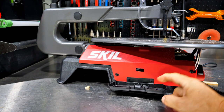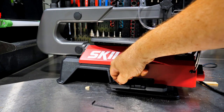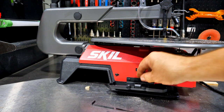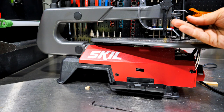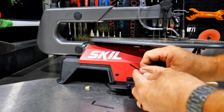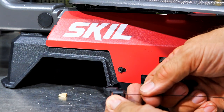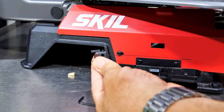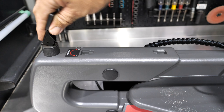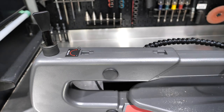The tool also has a convenient holder that captures all the extra bits — Allen keys, extra blades, and two adapters. The blades are fragile and bend easily. The adapters are for running unpinned blades; the current blade is a pinned type. For unpinned blades you use the adapter, run the screw out, and insert the blade. Blade tension is adjusted on top of the saw by flipping a clamp, tightening or loosening as needed.